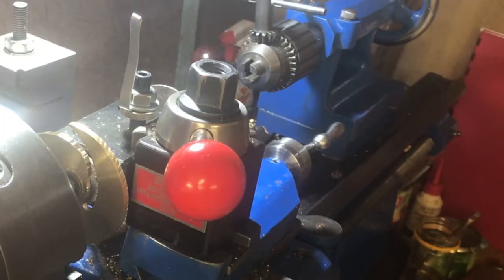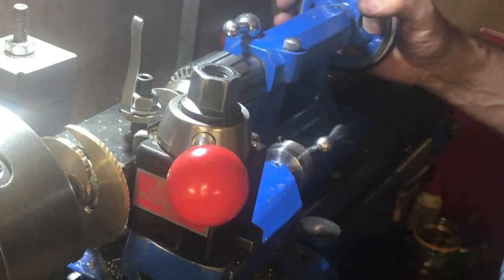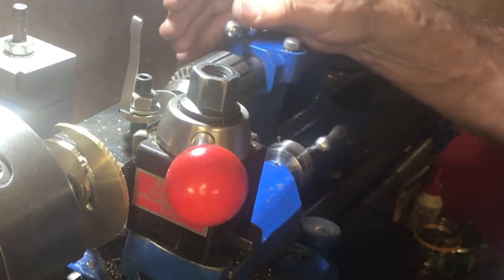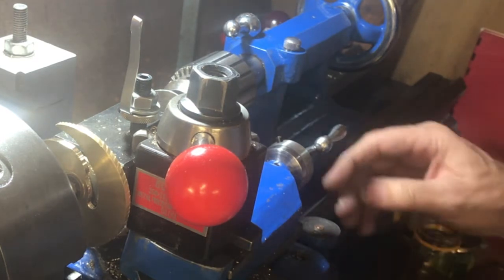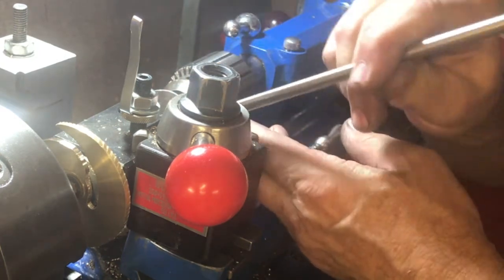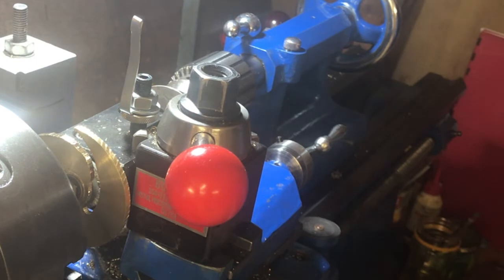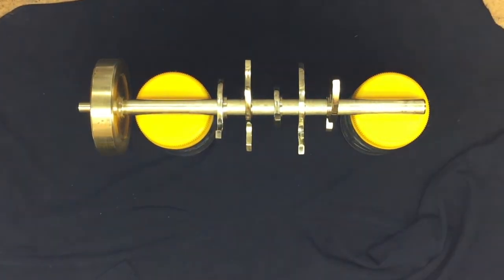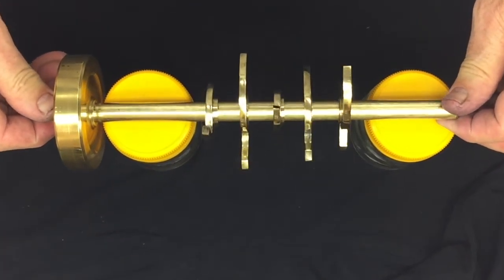What you've been watching is the very first attempt, and it's useful because you can see some of the problems that arose. I was surprised at how much force is actually applied to the aluminum pattern and also to the pin in the tailstock — the follower. All of this has to be really strong and rigid, and it worked a lot better once I used the first cam as a pattern. It probably wouldn't have been such a problem if I'd been cutting shallower cuts instead of trying to go through the full five millimeter thickness in one pass — you have to cover the same path each time. I had several problems with the pattern getting damaged or coming loose, and the follower in the tailstock moving.